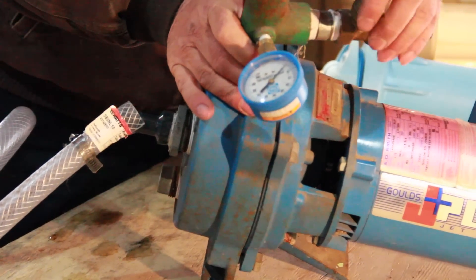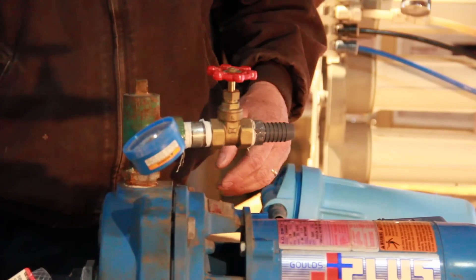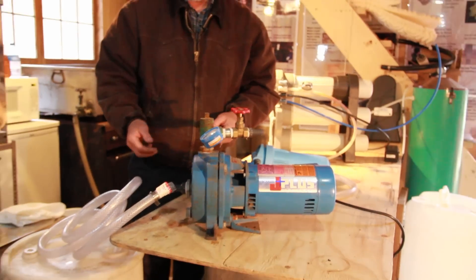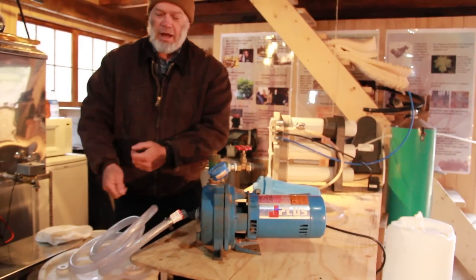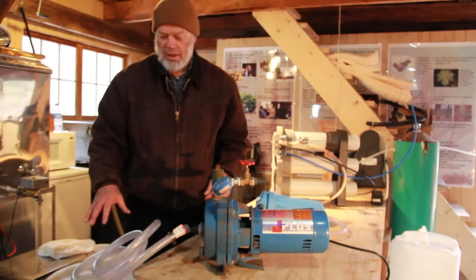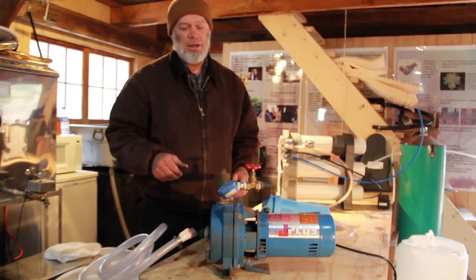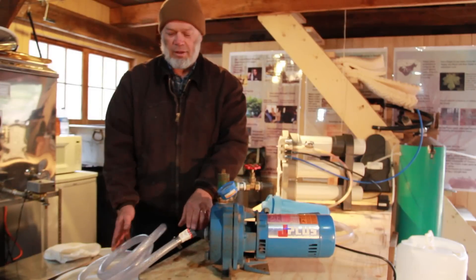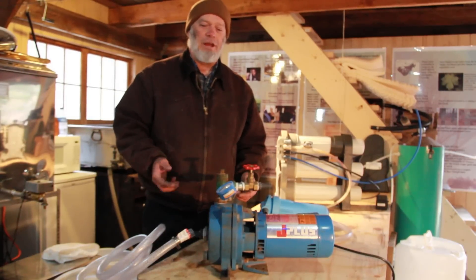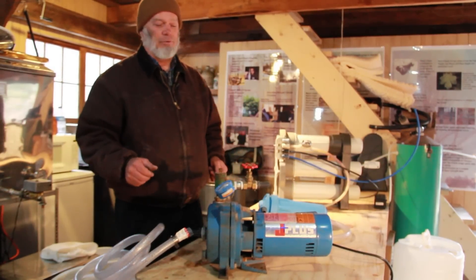Typically the pressure will be somewhere between 50 and 60 psi. This valve is needed because every time you need to change tanks — on a commercial RO those changes are made by valves inside the system, but for us, when this tank gets empty, I have to pull this line out and stick it in another tank. When I do that, I have to close this valve so that it doesn't suck air. If it sucks air, you lose prime. Priming a pump can be a pain — you have to fill the pump and the line, then turn it on. If there's air in there, the prime often won't take effect and the pump won't work. So a valve on the exit and a foot valve on the bottom of the line are critical.